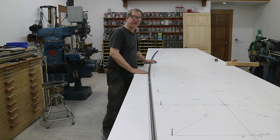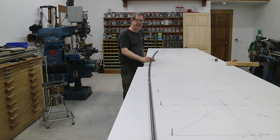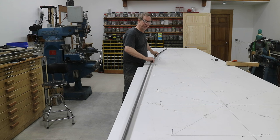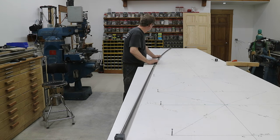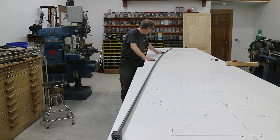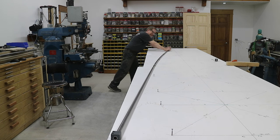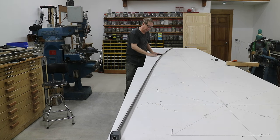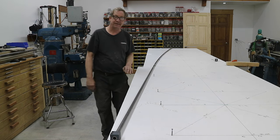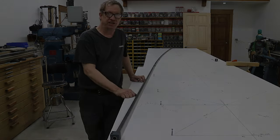Here's the view all the way down the tube. You can see we've got a nice arc started. And I put screws at the end of each station because I find it easier right now, when I'm not trying to clamp it in place, to just line it up on those. And actually, we're done. I've got a little extra bend here, but it's real easy to take out at this point, that thermal bend. And really, if I want, I can just push it to the screw. So that's the end of that part. Now I'll start bending these individual stations to match up here.